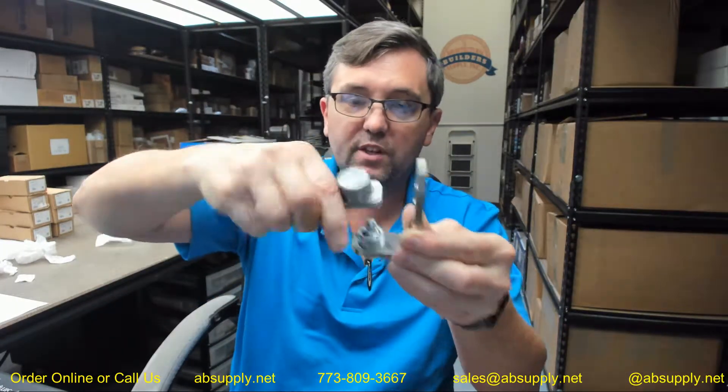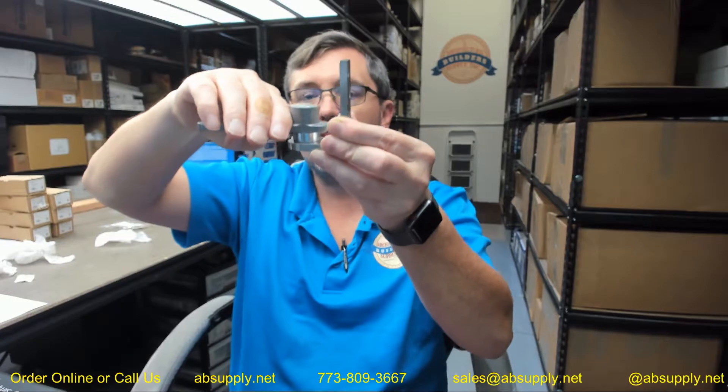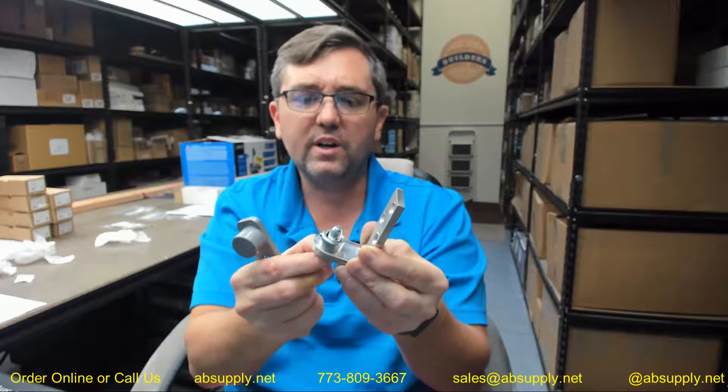You could mortise the door deeper to account for this as well. If you really wanted to draw that down maybe another quarter inch, you're going to have to get to that set screw — or if you already know what it is, you just tighten that to begin with and the entire door will just hang down further. When you have the actual parts, you can determine exactly how you'll modify your installation in terms of dimensional properties to suit your situation.